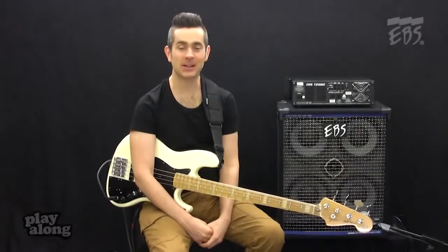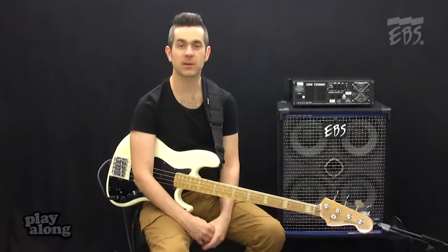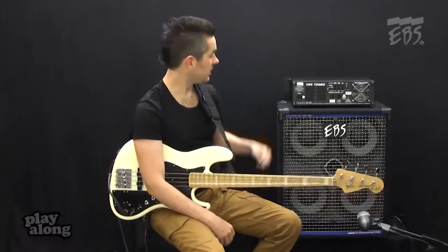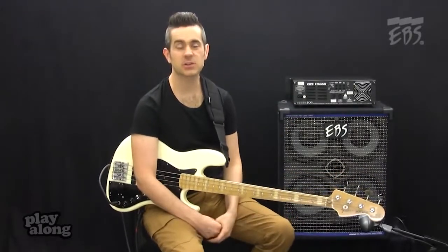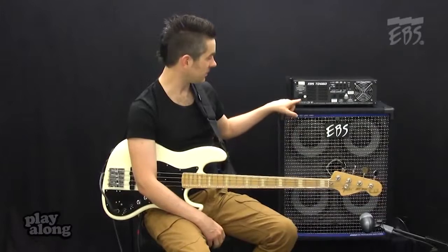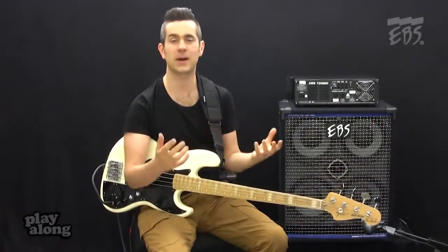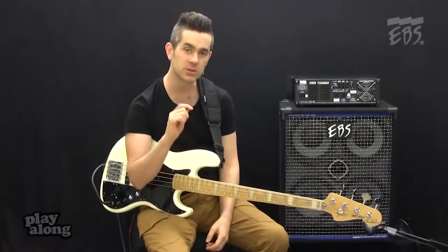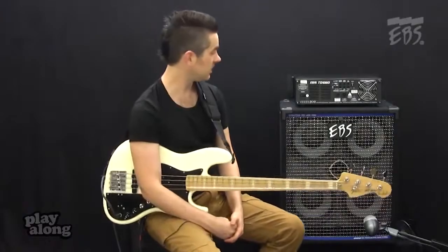Let's take a look at the back panel on the TD660. There's lots of great features here, so to get the most out of your amp, it's important to know what it can do. First up, our mains connector is a 3-point kettle lead, so that's an industry standard, but just below it, our fuse. If the fuse ever goes on your amp, there's nothing worse than having to unscrew panels and take them off. With this, we just pop the fuse out, replace it, back in. It takes about 10 seconds.